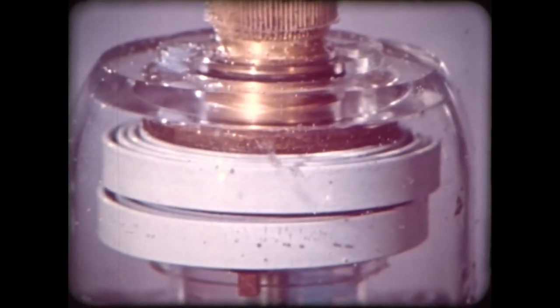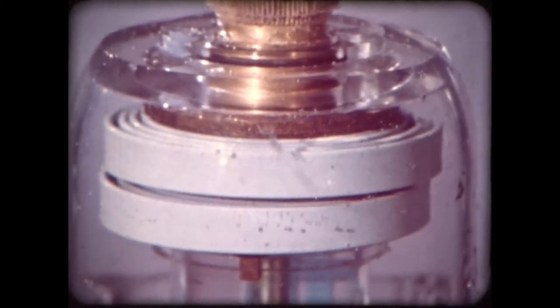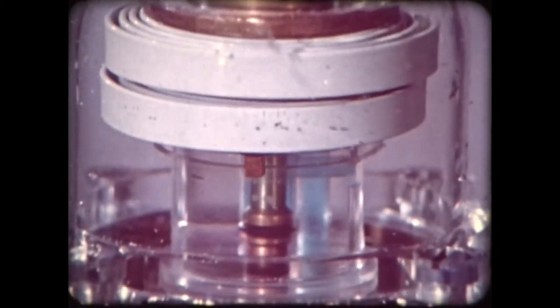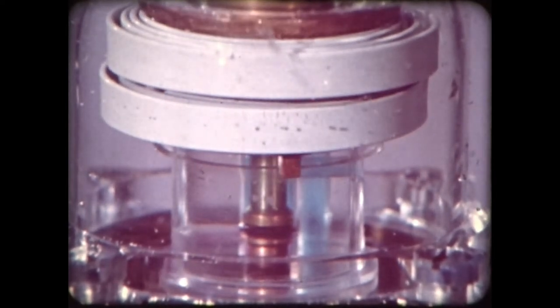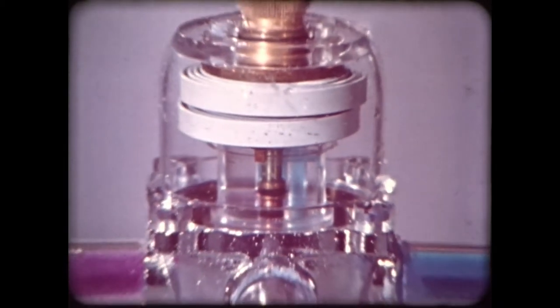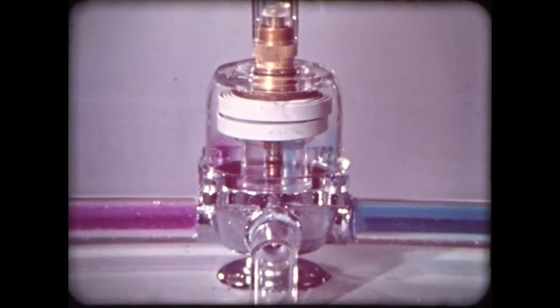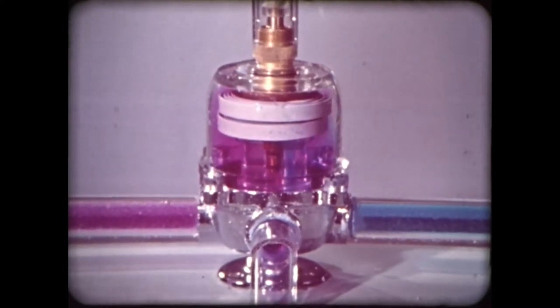At the top of the central assembly is a coil thermostat. The coil expands or contracts according to the temperature of the water inside the cover. This rotates a ported sleeve which regulates the proportion of hot and cold water. So that when the valve is turned on, if for example the initial flow is too hot, the thermostat reacts and rotates the ported sleeve to cut down the flow of hot water and let in more cold.